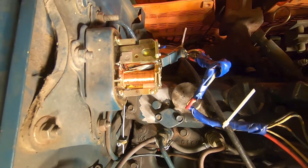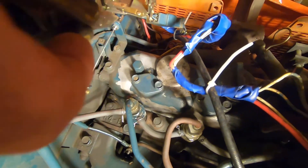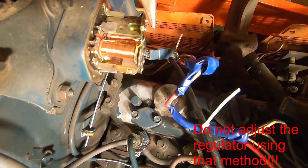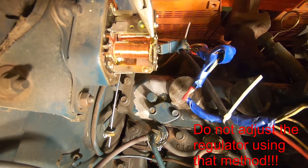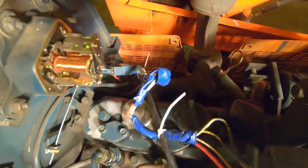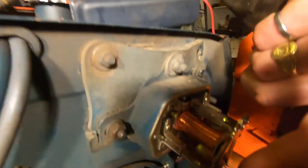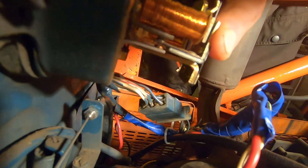That's the information that was missing in other videos. I've also seen people talk about adjusting the output voltage based on these contacts right here — you could bend these contacts up and down. In my Kubota manual, it doesn't talk about that. It talks about bending this to adjust the voltage, but the picture in the manual was so poor I couldn't tell what was being bent. Right between here and here there's a contact, and between here and here there's a contact.